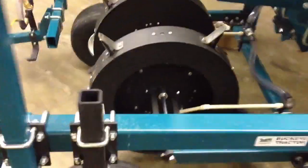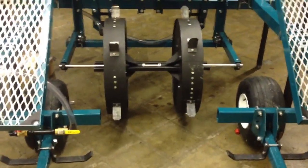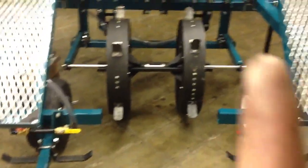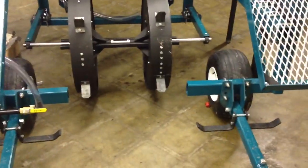There are a lot of adjustments on this thing — it's pretty cool, pretty happy with it. There are pegs there to put your feet up on. This should definitely help in the planting process — no more hand planting. I got the wheels set up at 18-inch centers both ways, and the spikes are 18 inches, so you'll have 18 by 18 centers.